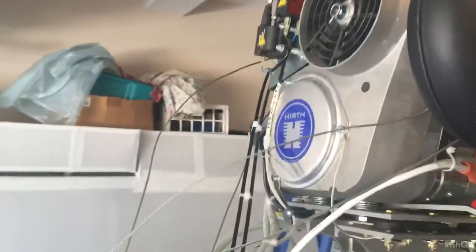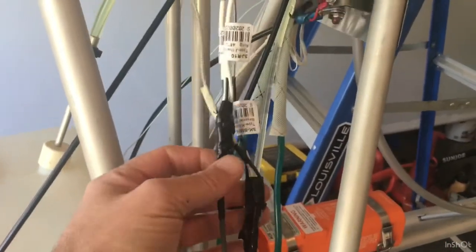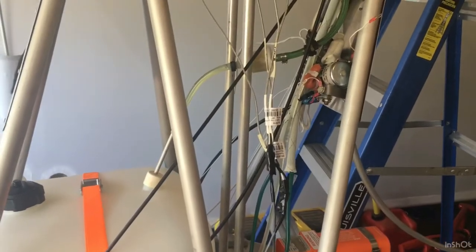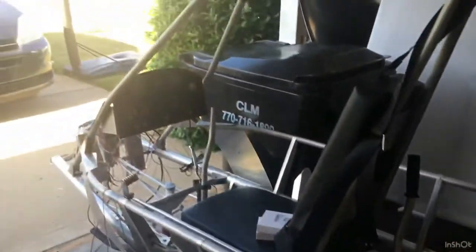And then clean it up in there too, and clean up my new EGT and CHT probes which are installed. These are the new bundles that I did - no grounds or anything like that. This run has the sending probes, the EGT probes, and then the CHT senders, running right into the little gray wires and then up to the front on the instruments. Three sections, that's it.